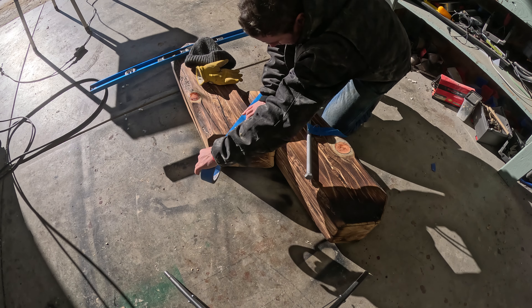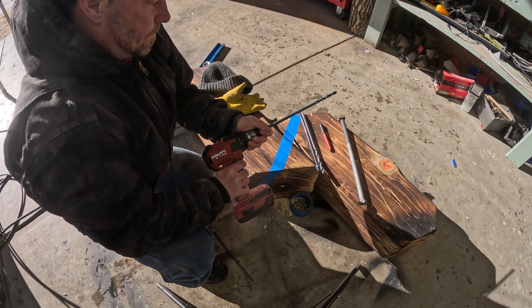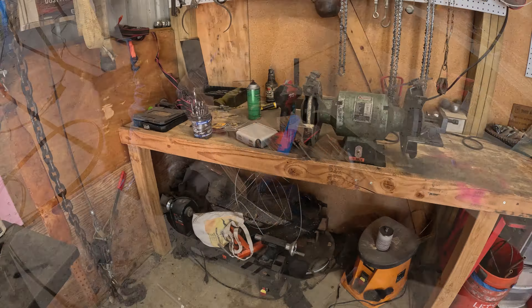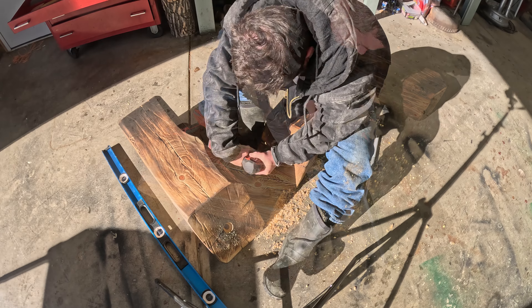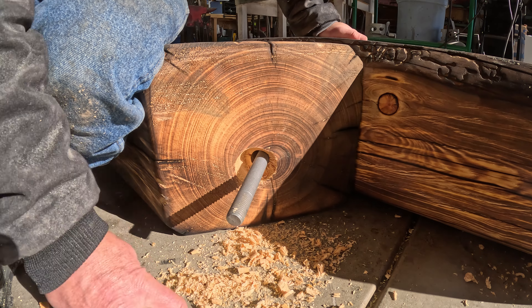Then I'll apply those large metal straps over the top so you won't even know that bolt is there. I put blue painter's tape on there — and I hate painter's tape — but just to give me a visual of the angle I'm going to be drilling at. This was a pretty cumbersome process; I needed to use all sorts of bits because the bolt going through is probably three-quarters of an inch in thickness and none of my drill bits were long enough.